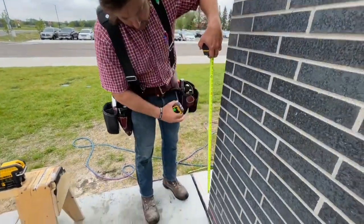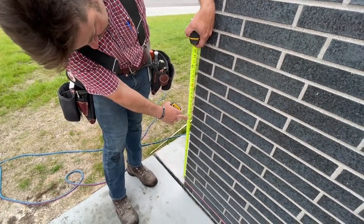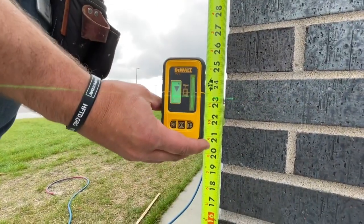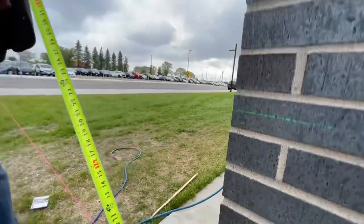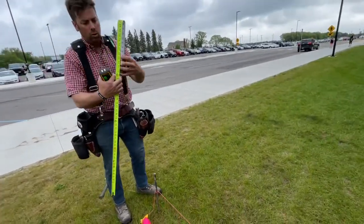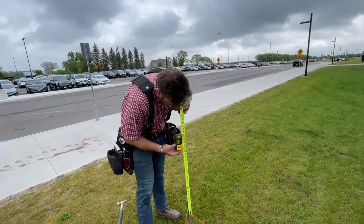The advantage of this is we can get a height off of our building. If we touch off on the top of that brick edge, we can visually see we're at 23 and a quarter. The center of the receiver line should tell us the same thing — 23 and a quarter on the tape. If we wanted to determine level out here or a percentage of drop, fold the tape over, hold it in one hand, set the tape on top of your string line, then move your receiver until you get a signal.